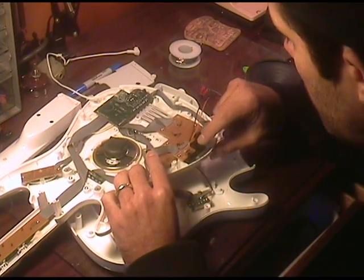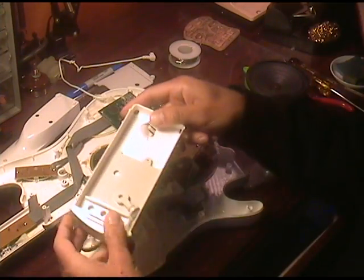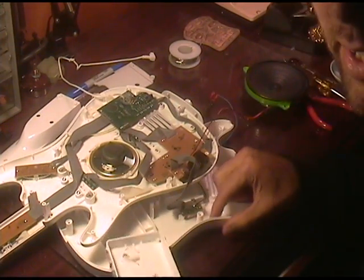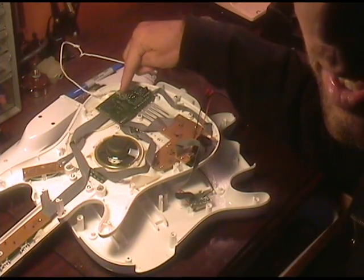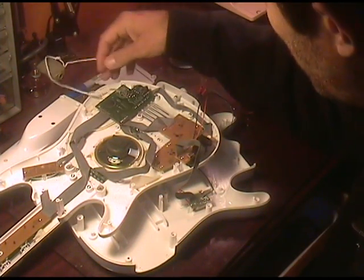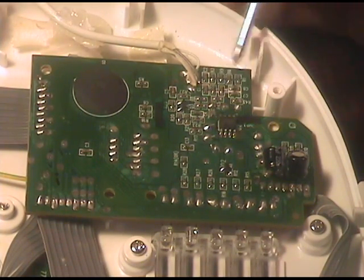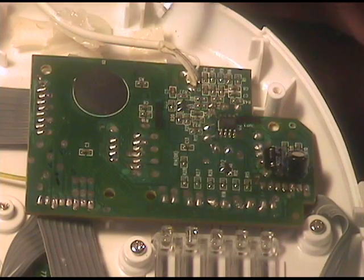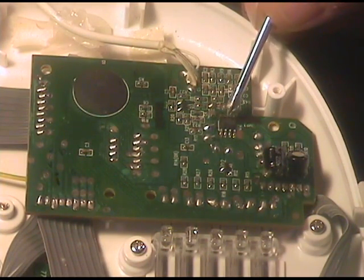And I guess I have an alternate input over here too, so I've got a lot to play with. There was an iPod dock in the side of the guitar, so that means there's a line input going back into the circuit board where this wire comes in. I think I'll be looking for a feedback loop that I can generate from this area here — that's where the iPod dock comes back in at line level; it feeds into this op-amp.